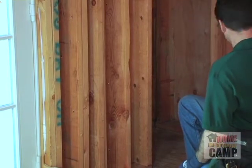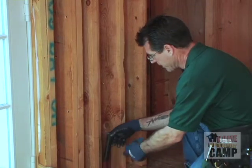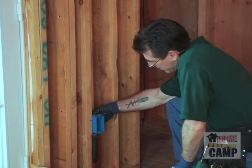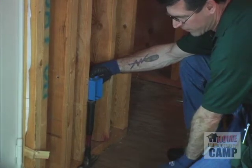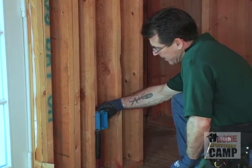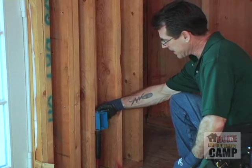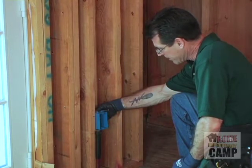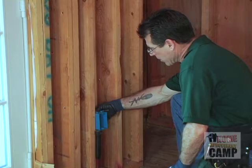Another little trick that we used to do is use our hammer height. If I just set my hammer on the floor and set my box on top of it, it's going to be pretty close. In this case, it would be about 17 to the top. Depending on what you have for a floor surface, if you have a 5/8 carpet pad, another 1/2 inch with a carpet, you're going to be raising it up an inch, in which case this would be great. The only problem is every electrician's hammer may be a slightly different height, so you may get outlet heights slightly different. In this case, it would work perfectly just to use hammer height. It's going to give about 1 inch for any type of material they put on the floor.